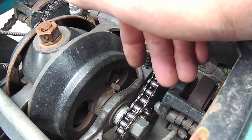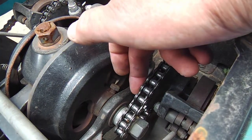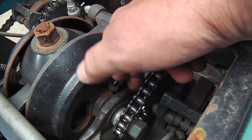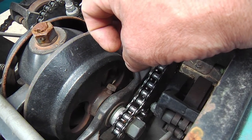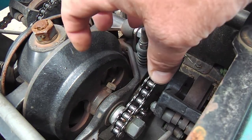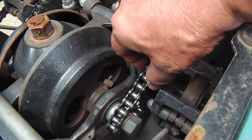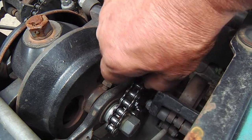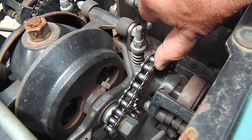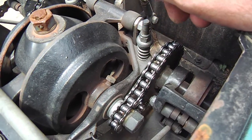Keep your system in order, and remember these chains too, because if they stretch out too much you'll hear some grating, grinding. When you're turning especially, the torque forces on these will cause the chain to twist and kind of ride up on the side and then crunch back down. So that's what I was hearing — I thought it was on the outer chain, but it wasn't.